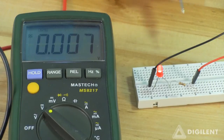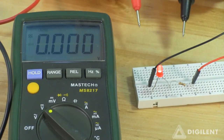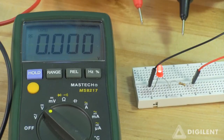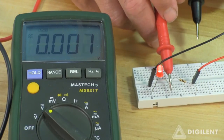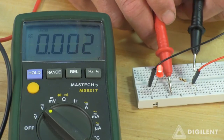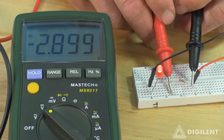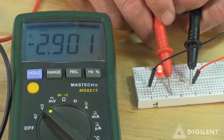Now let's measure the voltage across the resistor, V2. Our assumed voltage polarity is that the terminal connected to the diode is at the higher voltage. Connecting the volt ohm terminal of the DMM to that point and the COM terminal to the voltage supply results in a measured voltage of about negative 2.9 volts. The minus sign indicates that the actual voltage polarity is opposite to our assumption, but that shouldn't bother us since we know how to interpret the negative sign.